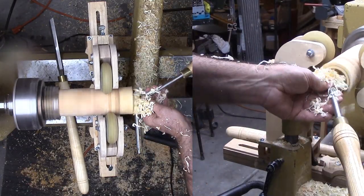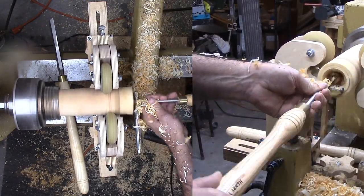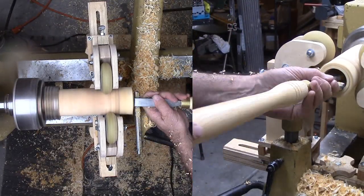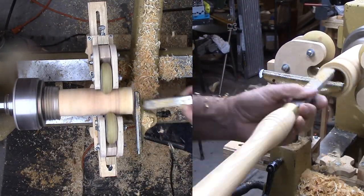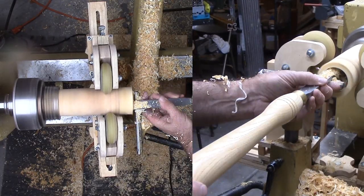I'm hoping the new turning center is close to the original, else I'll have problems later lining up the center hollowing. Back to hollowing — first with a gouge, then with a scraper. The tool rest is higher for the scraper so that the scraper is not as aggressive in the cut.